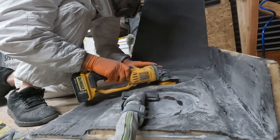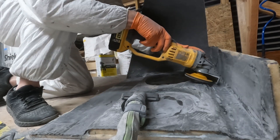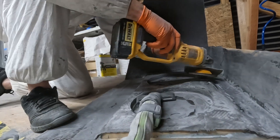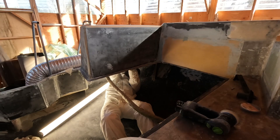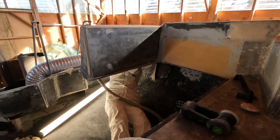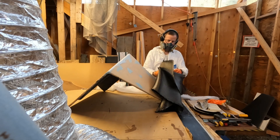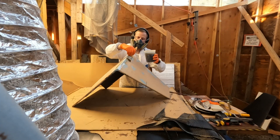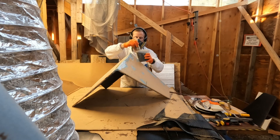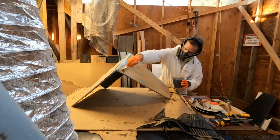On the other piece, which I didn't really film glassing, it came out a little worse. The actual spots where the propane tanks are gonna sit came out really well because I made melamine cutouts and put them in there with weights on top, but that kind of messed up the surrounding areas. I had to go back and grind and sand a bunch to fix it up. The outside was a lot easier because there wasn't all that shape and profile to it — just one big radius bend — and then get this side glassed up too.